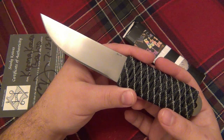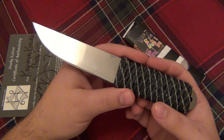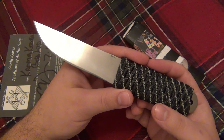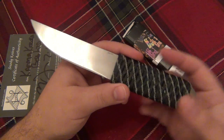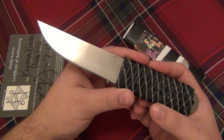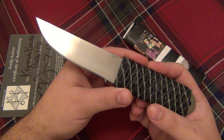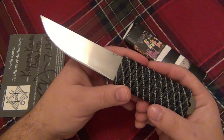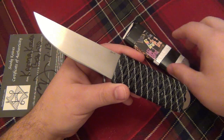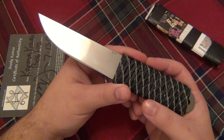I'm going to give you a quick lesson on BG-42. BG-42 is basically designed for aerospace bearings — it has a lot of wear resistance and very good corrosion resistance. I'm going to reference the Chris Reeves Sebenza knives because that's really my only experience with BG-42 prior to this knife. Back in the day before S30V was the big deal, BG-42 was a big deal and the Chris Reeves Sebenza models were all BG-42. Before that they were ATS-34, which is basically the equivalent of 154CM — a Japanese version.